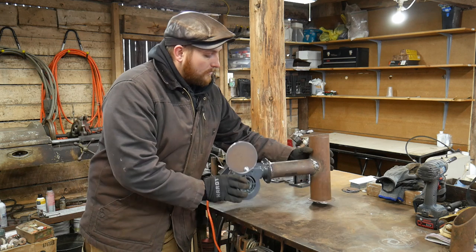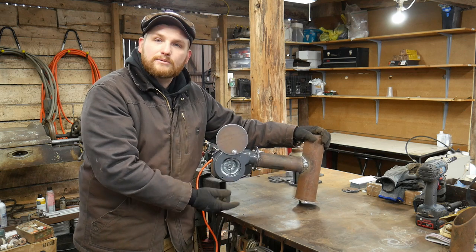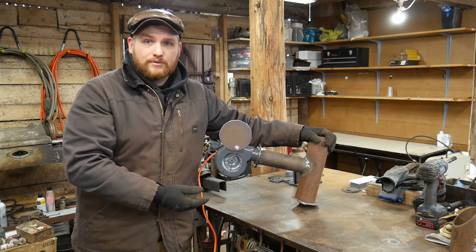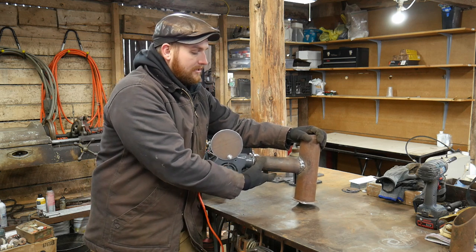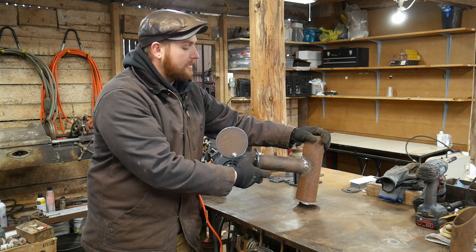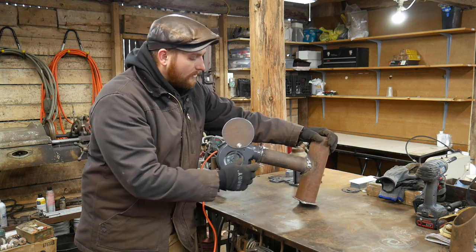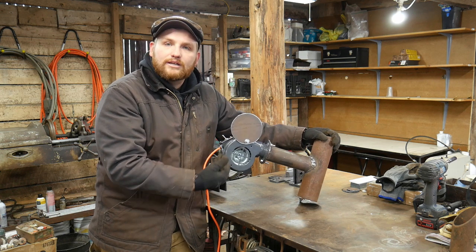The pipe that I made here is just a standard T pipe. You could get this with plumbing fittings off the shelf, although a lot more expensive if you don't have a welder. Again, you can plumb this up with some black iron fittings. This is what they call a 3-inch blower here, the outlet here. Really, it's more like 2, 2.5-inch pipe, so you can get by just fine with some black iron right there. Really, all you need is a flange, though, that you can take and bolt this piece up to.